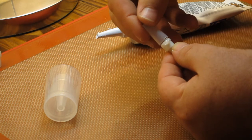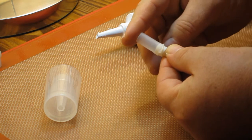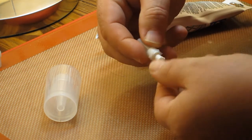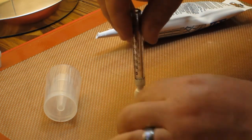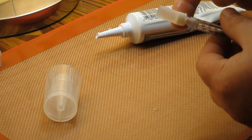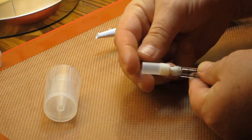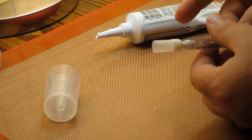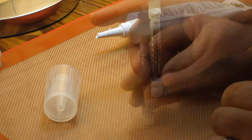When you put the silicone tube on, make sure you don't disturb the fill you put into the lock collar earlier — try to keep it straight. Give it a little twist to make sure all the surface is made up nicely. I used the one-milliliter syringe chucked into the drill to spin this around and used my finger to smooth any excess silicone on the end. Check again to make sure it's straight and that you've got a good seal and a smooth finish. Then set it aside and let it cure for at least 24 hours.